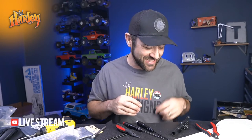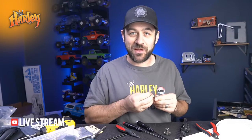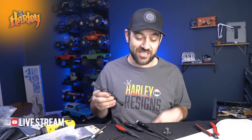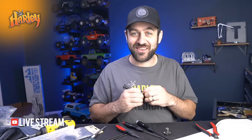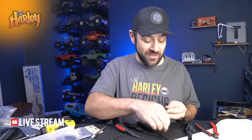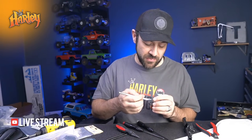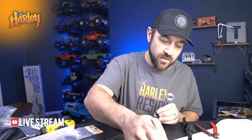VS410, all brass edition. We have joked many times about, for April Fools, just picking up a piece of brass material the size that we have our axles done in. It wouldn't take anything for us to swap to a different brass for machining and make brass axle housings, just for a joke. The only reason we don't make a lot more brass is that we don't want to contaminate chips between the aluminum and the brass in our setup, for the recycling and all that.